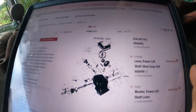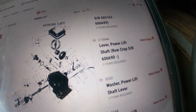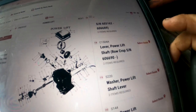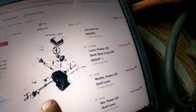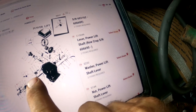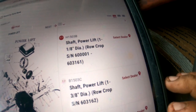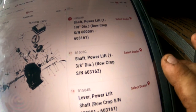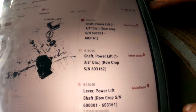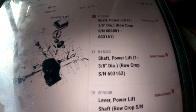So what's going on here? Why did they do this? Neither one of us had really encountered this before, so I dug through the parts books and discovered something else. When you go to the shaft listing, it tells us that the H-1503B shaft is inch and an eighth diameter, and then the next one down says inch and three-eighths diameter. So that explains the two different sizes.